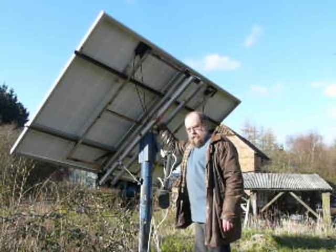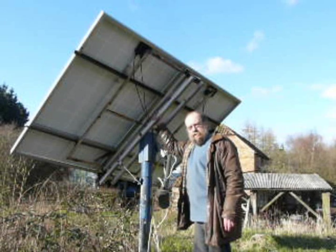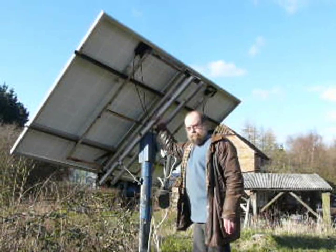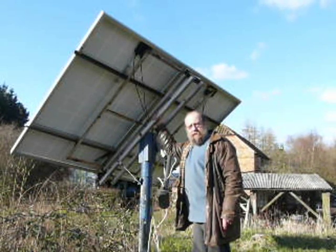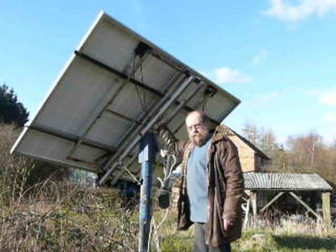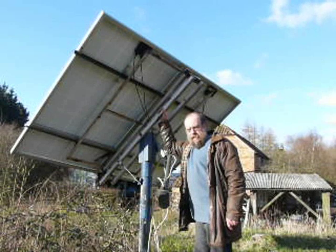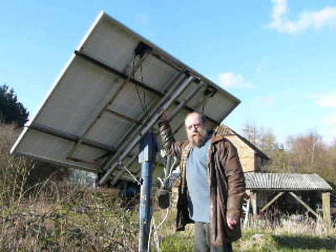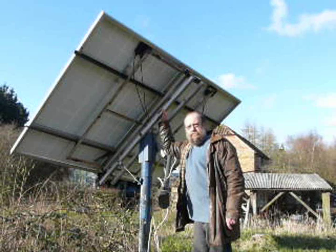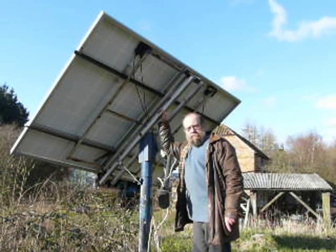This has got two 250-watt, nominal 24-volt panels. That means the maximum power point on these panels is 30.4 volts, which takes account of rising battery voltage and reduction in panel voltage as the temperature goes up. There's a lot more detail about these specifics in the book, and also there's a 200-minute series of videos on the Lilly website covering all this system, batteries, grid ties, making your own solar panels, etc. I'll put the links in the details on this video.